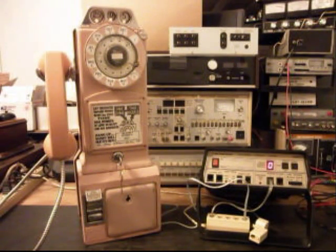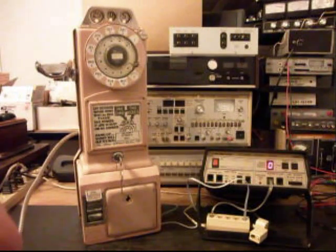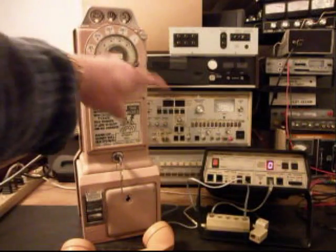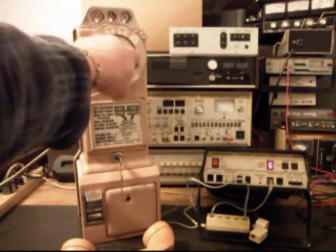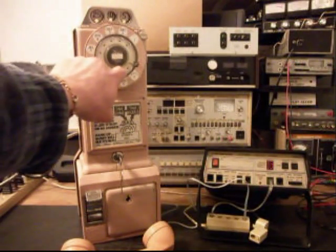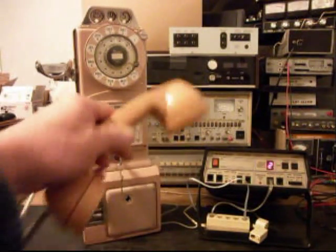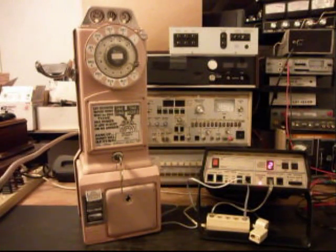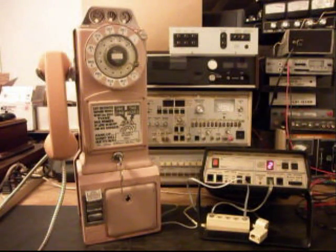And we want to go ahead and give you some dial tones, since the last thing we were working on was the handset. And now what we want to do is dial our numbers out. If you watch the analyzer, you'll watch them go by. I'm going to end in a 2, and I'm going to go ahead and transmit into the handset. So if you watch this red light on the analyzer, every time that red light lights, that's an indication of 100% modulation on transmit. 1, 2, 3, 4, 5, 6. Hello, hello. So we know that this telephone has transmit, receive, it's dialing out.